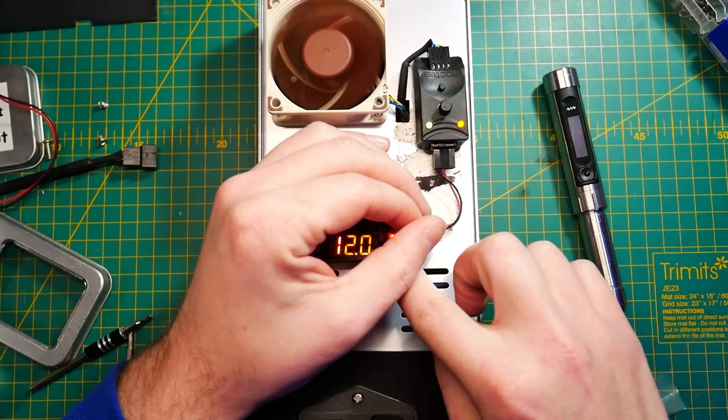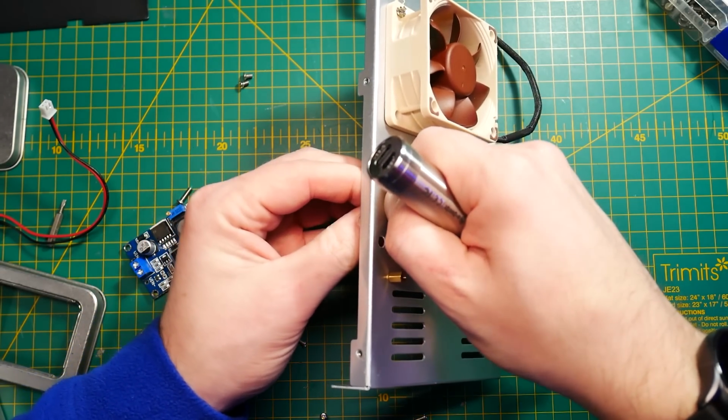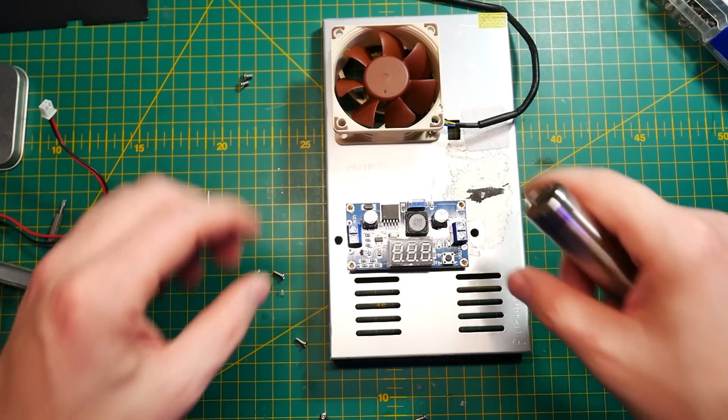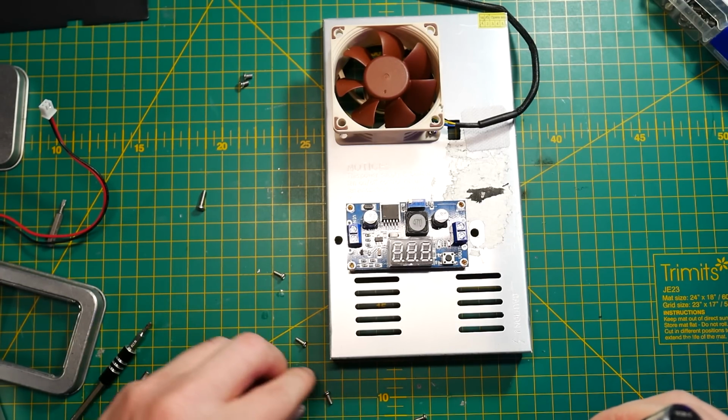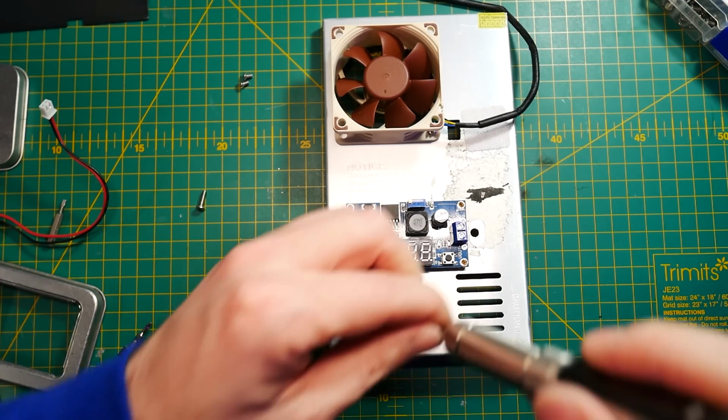If you find out that yours has a switch and disables the power and the fan isn't needed, then you'll have to hook up to the regular 24 volt pins at the bottom of the power supply. I've used the drill and a couple of standoffs to mount the PCB, and later on I'm probably going to print a cover for it so I don't suffer from accidental shorts.